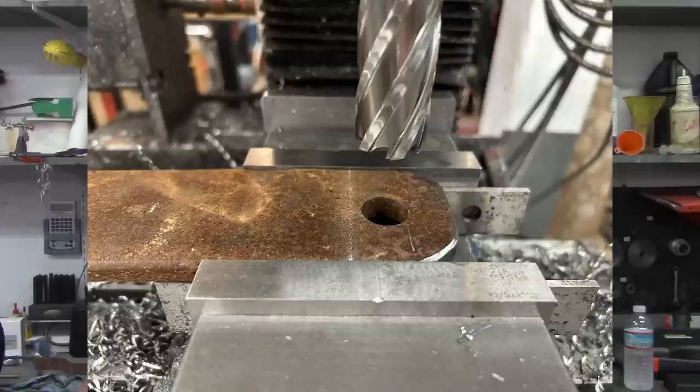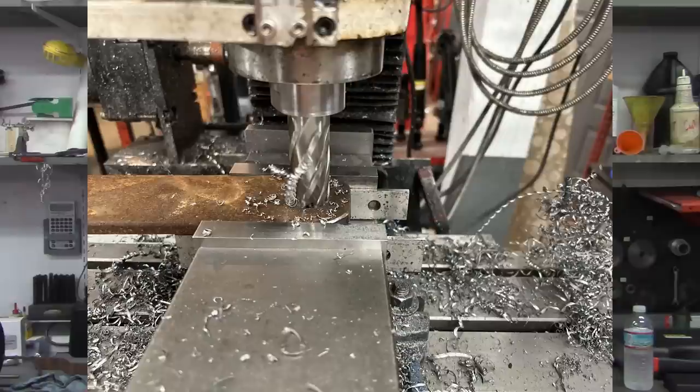After that I put it in the mill. The hole I wanted to make in this is a one inch hole. I think she'll probably use an inch and seven eighths ball, which has a three quarter inch shaft or pin, but I wanted to go ahead and put a one inch in this in case she ever does want to put a two inch ball on. So I used my one inch annular cutter. As you can see, there was already a hole in this piece, but that hole was punched and somewhat oblong — only about a five eighths hole. I lined up the one inch annular cutter over that hole and cut it out. I'm really beginning to like these annular cutters.